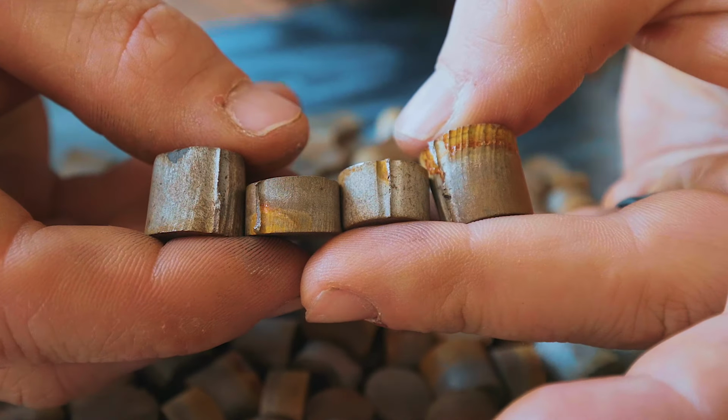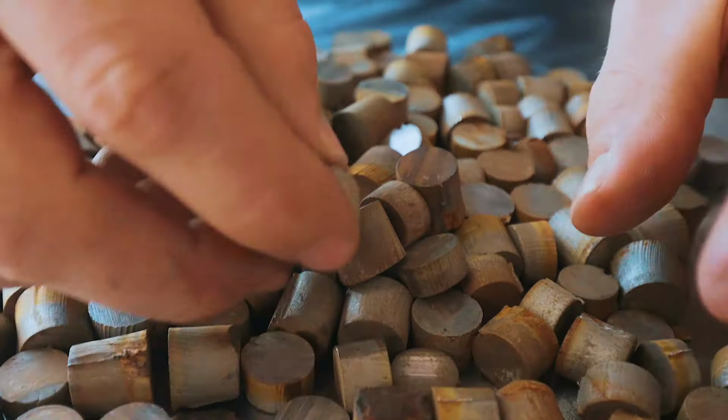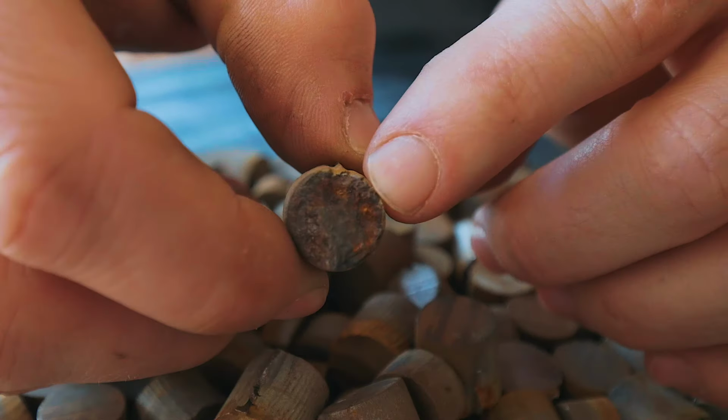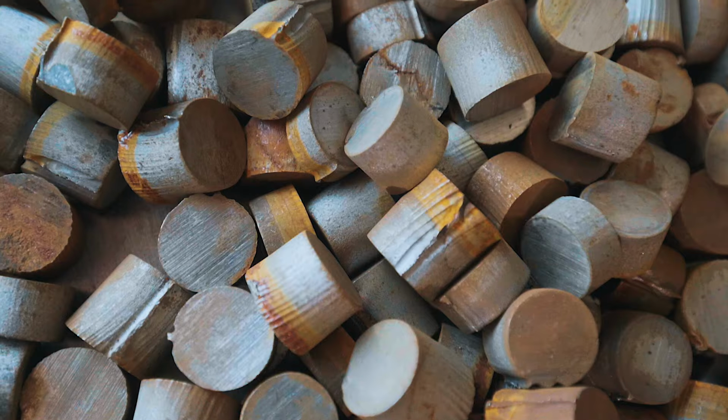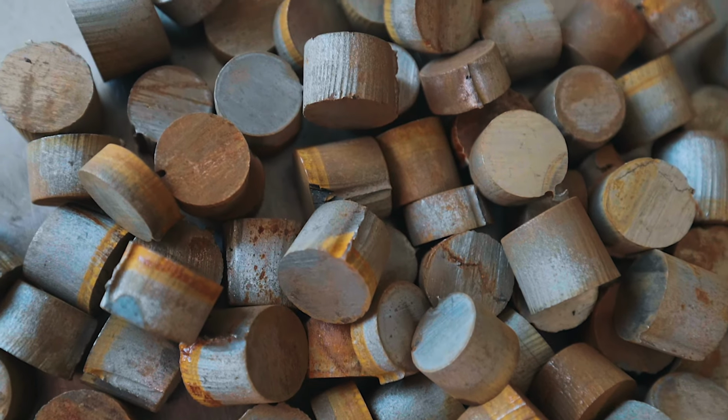Based on the style of ring they made, and the meteorite they cut it from, obviously we got a whole load of different thicknesses of stuff to work with. Some of it has the exterior part of the meteorite on it. Some have little funky corners. So we need to do this in a way that we can essentially have random bits of material in our Damascus, and there is no better process for that, I think, than canister welding.